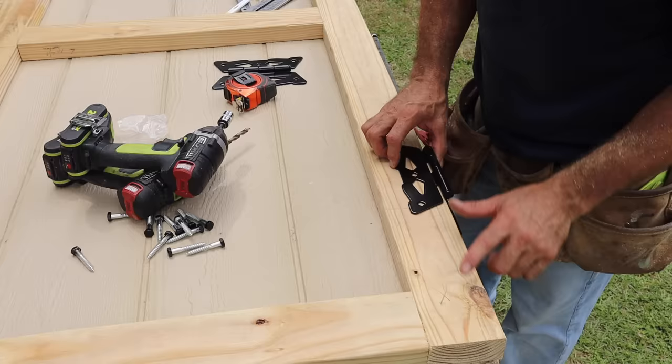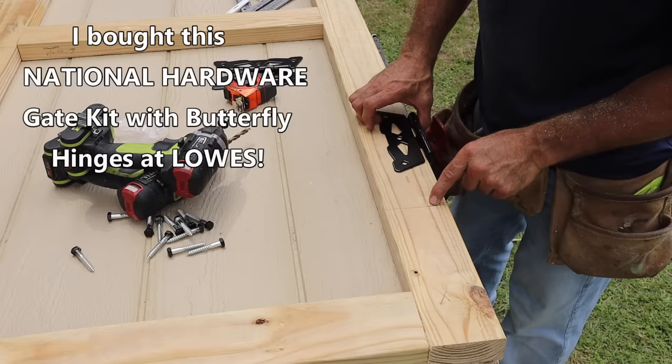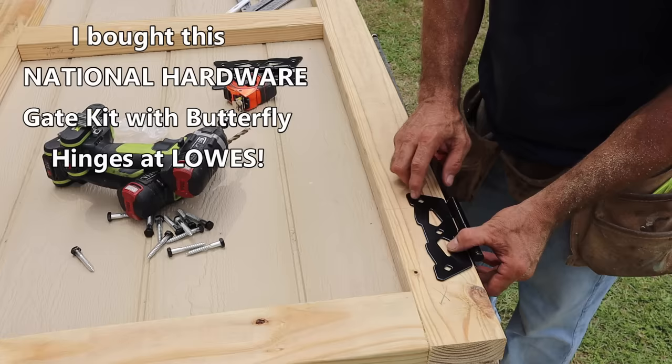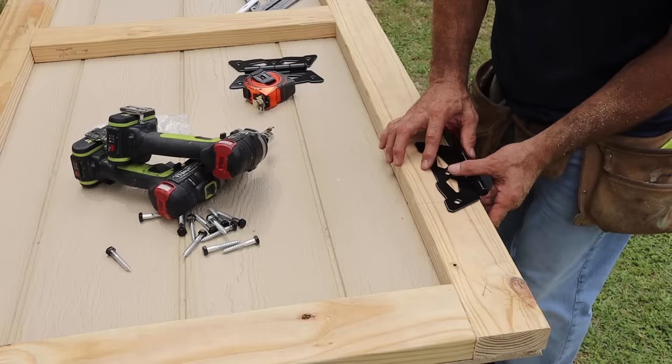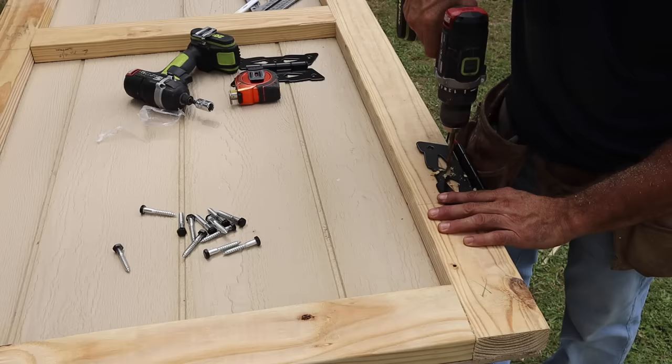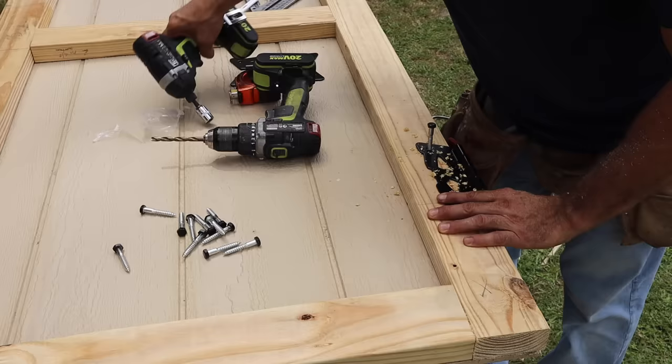For the top of my door I want the top of the hinge to go 10 inches in from the bottom and from the top. That's where the top pin will go, and the bottom of the pin will align with that line. I'll set it flush on the wall so I can pinch it both ways. I'll pre-drill and start them off — I have a half-inch socket.